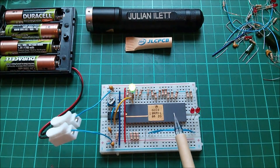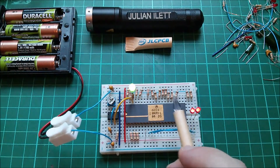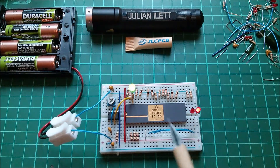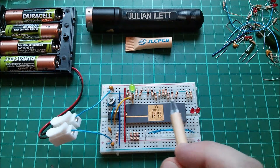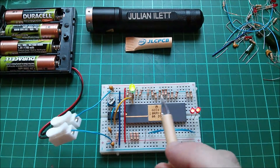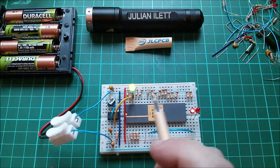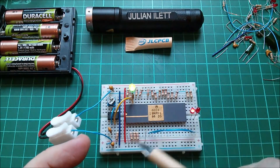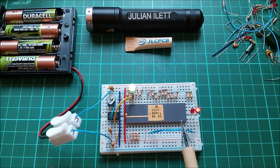It's being clocked at about 10 hertz. This is a microprocessor, so all it's going to do is say, I better go and fetch an opcode from the data bus. So here's the data bus up here - these eight resistors. Bit 7 is actually on the right. So it's pulling in this opcode. The microprocessor would normally pull in opcodes from a ROM and they'd all be different. Here it's pulling in the same opcode repeatedly, doing the same thing over and over again.